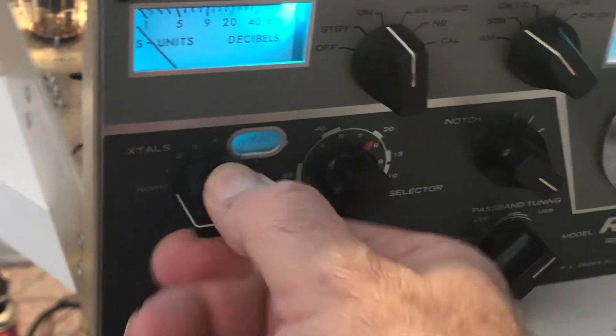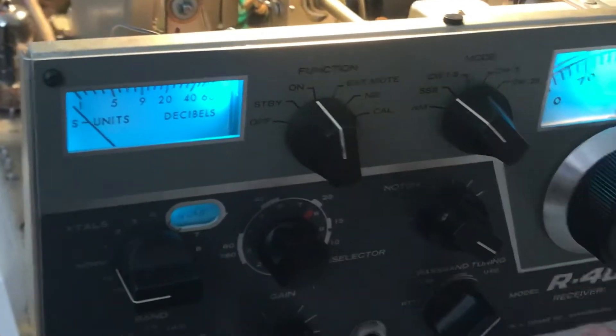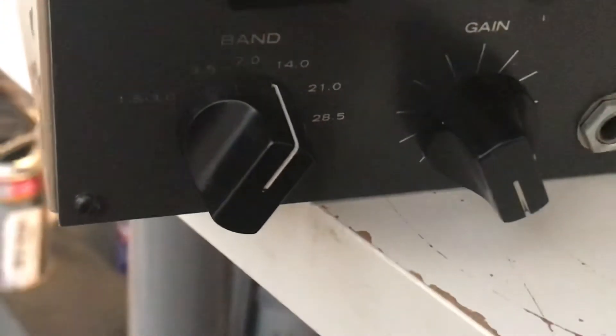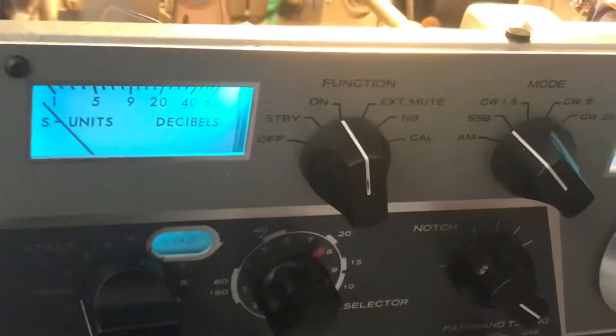I hope when something works, don't fuss with it. It seems like it's working somewhat — speaker's in. AM mode — we're on. Sideband — does AM work? Yep. So it looks like those diodes ran wrong or something bad happened here. That's too bad. Now I gotta take it all back apart. If AM works, which it does, that detector is working and I screwed something up.